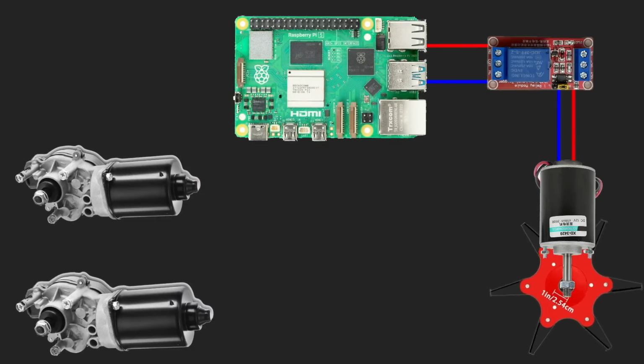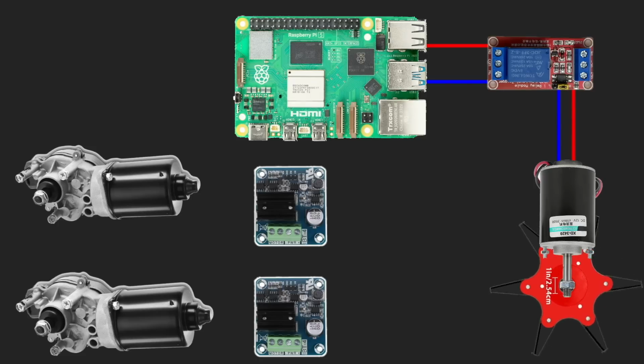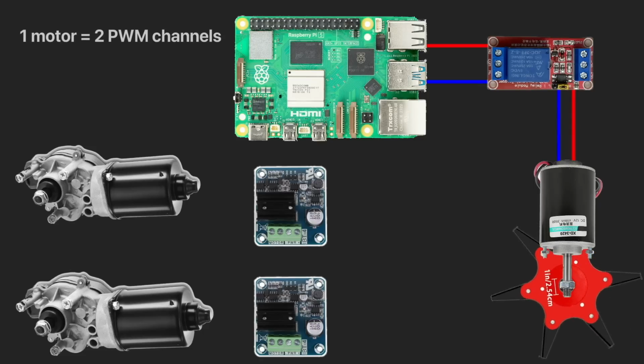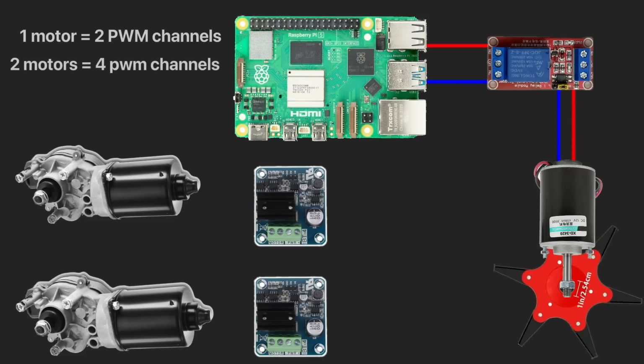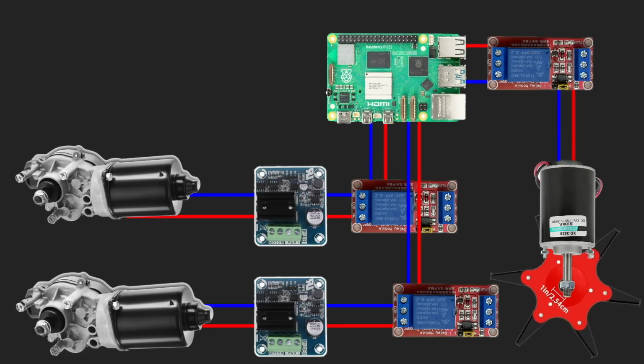Next, I need to control speed and rotation direction, so I am adding several H-bridges. I have a separate video that explains how to control a motor with an H-bridge. You can check it out on my channel if you want. The first limitation is that in order to control a single motor, I need 2 pulse width modulation channels. But I have 2 motors, which means that I need 4 channels. To solve this problem, I'm adding 2 more relays that will switch the signal between pins. I will explain how it works in the connection schema section in this video.